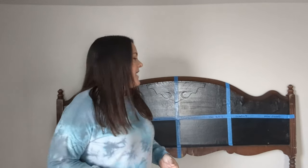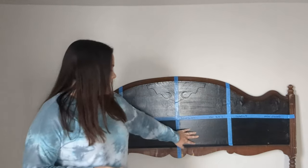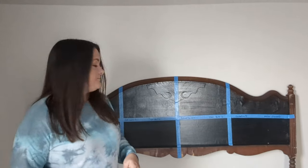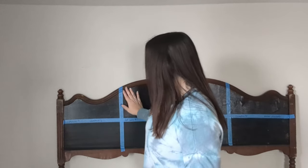Now for the sealers that did well. The CrystalLac Ultimate Polyurethane did really well — and this is actually the worst section of the headboard because it has all these cracks in the veneer, with lots of potential for bubbling or discoloration where sealer could build up in thicker layers. And it still did great. The Dixie Belle Gator Hide also applied well and has a slightly less shiny satin finish, which is really nice. The General Finishes High Performance Satin Top Coat did just as beautifully as it always does. And the Minwax Polycrylic also did really well — it went on smoothly with no graying, and some bubbles evened out on their own.